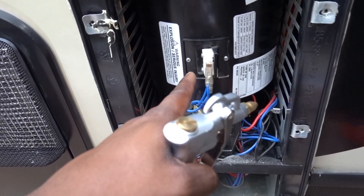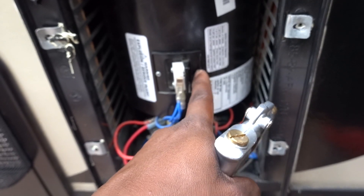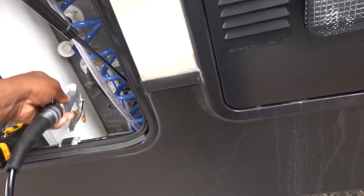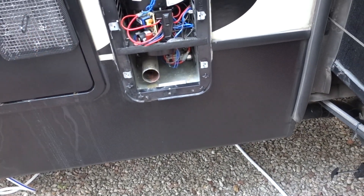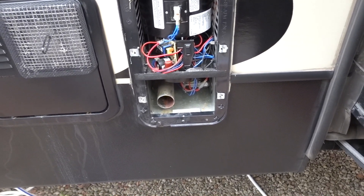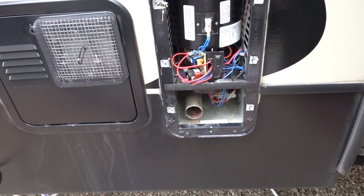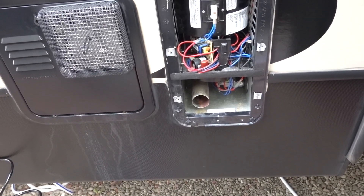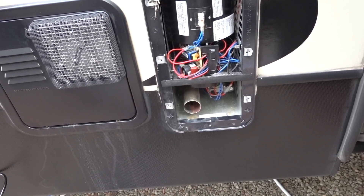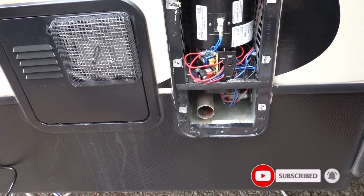I put the sail switch back in — it's all cleaned off. There are only two screws holding on each side, so be very careful not to strip those out. I used a small screwdriver since those screws were kind of unique. I hope this was helpful — be sure to tackle this. I'd also recommend going in the owner's manual to see if there's anything else you should be doing to your furnace. For now, I just wanted to clean off the sail switch, clean out the exhaust, and we should be good to go for another year or so.